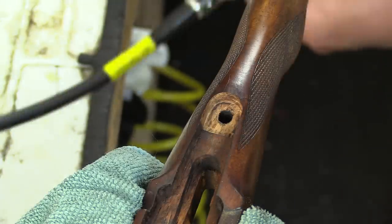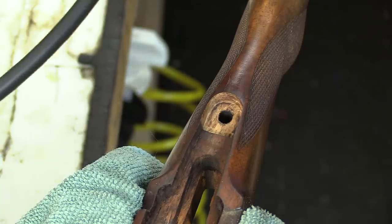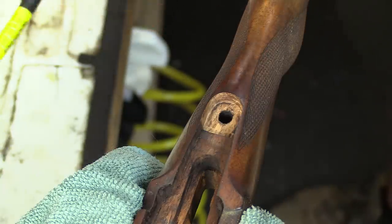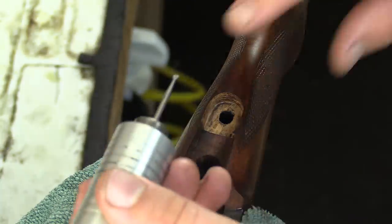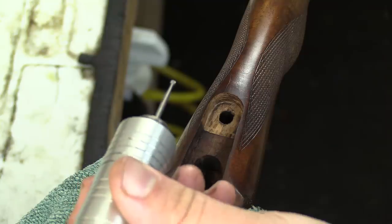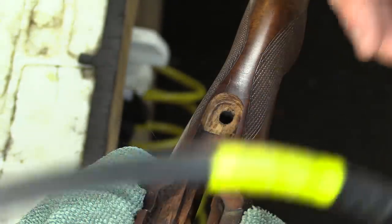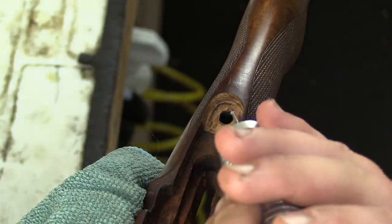Okay, so I'm not going to use this. Actually, if that cutter was a little bit smaller, I could use the same one, but I'm going to swap it out for a slightly smaller one. We're going to take this small ball right here and go in and make ourselves some divots so that the glass has got a mechanical bond to make. Hopefully you guys can see what I'm doing. I'm going to come in from a few different angles here.